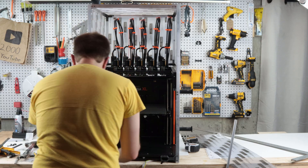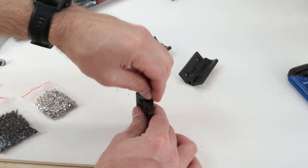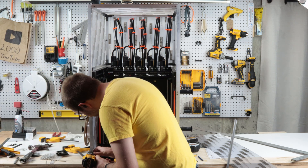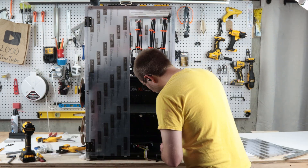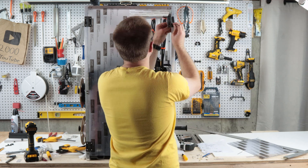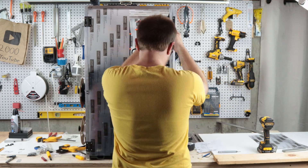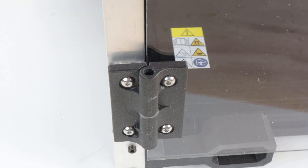I built in all the polycarbonate panels, did a final fit check, and then it was time to move on to the door. For the hinges I found an enclosure hinge design on Printables — thanks CHKing for that. I marked roughly where I wanted the hinges to go, used a center punch, and drilled the holes slightly oversized so there'd be a little variability to fine-tune the position of the doors. The only holes I needed to drill in the polycarbonate itself were the holes to attach the hinges to the doors. After mounting the hinges to the aluminum, I held the doors in place, marked where those holes needed to go, drilled them, and bolted it together. I also made small spacers out of leftover polycarbonate to offset the hinges from the aluminum.